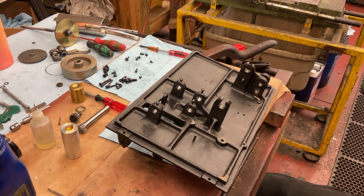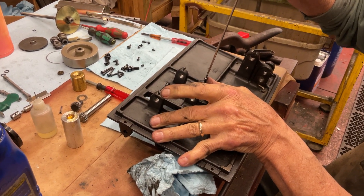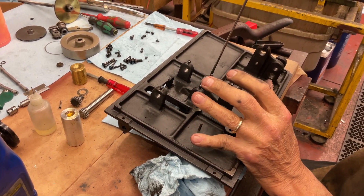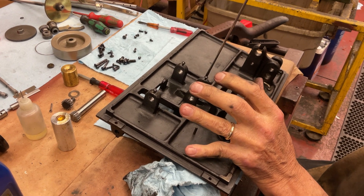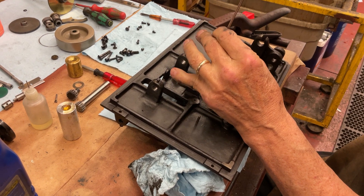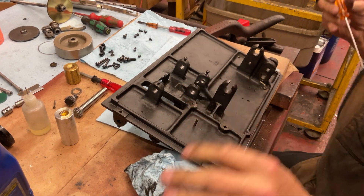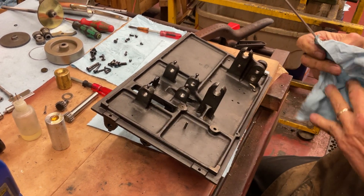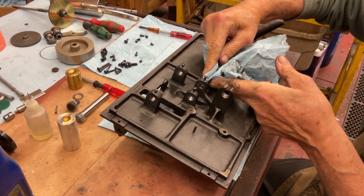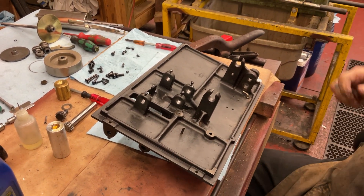I've done the bottom, but what you want to do is put them in. We've pre-oiled it — you can see I have a little oil on there. You want to run it all the way down and all the way out. Why do we do that? Because there's crud in the threads, and you'll see you got a little dirt out of the hole. So you just come in with a paper towel and wipe that out and it's gone. Now we'll start to assemble.